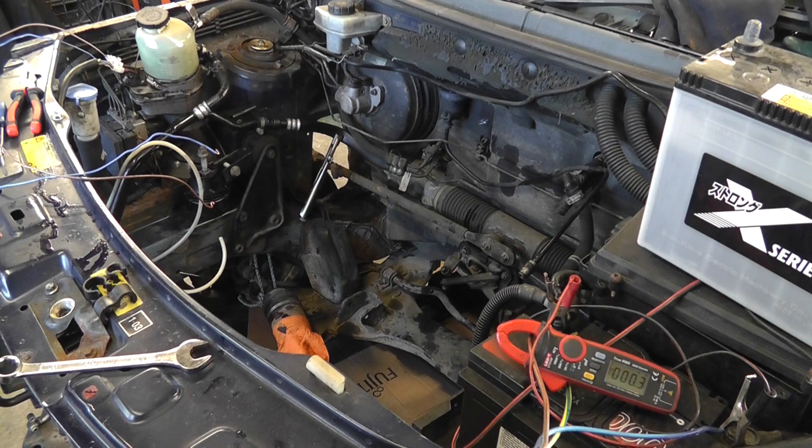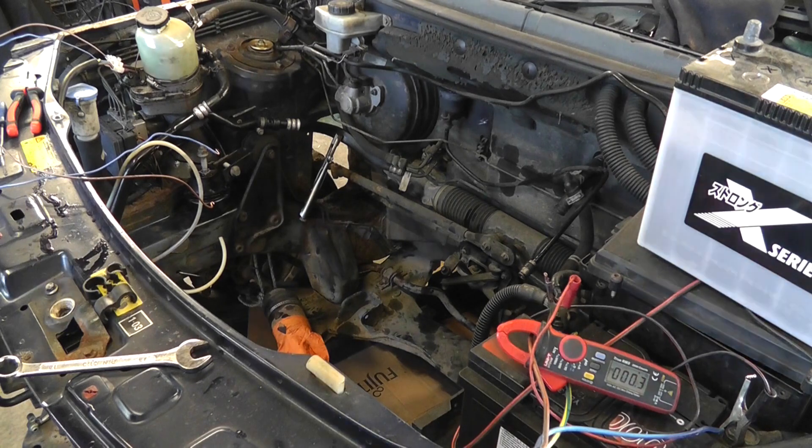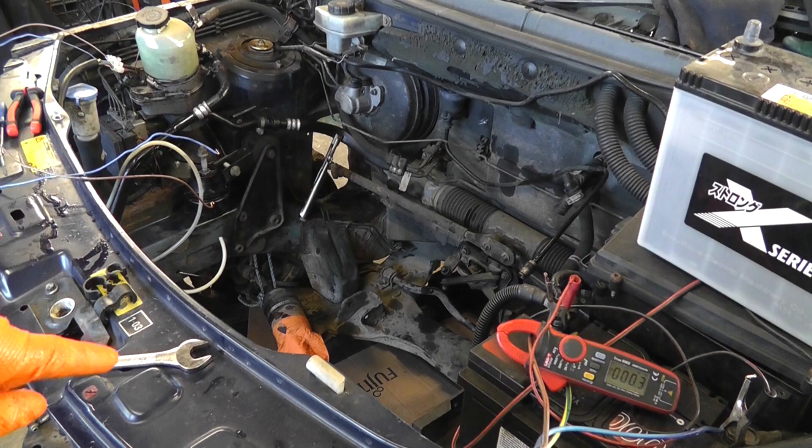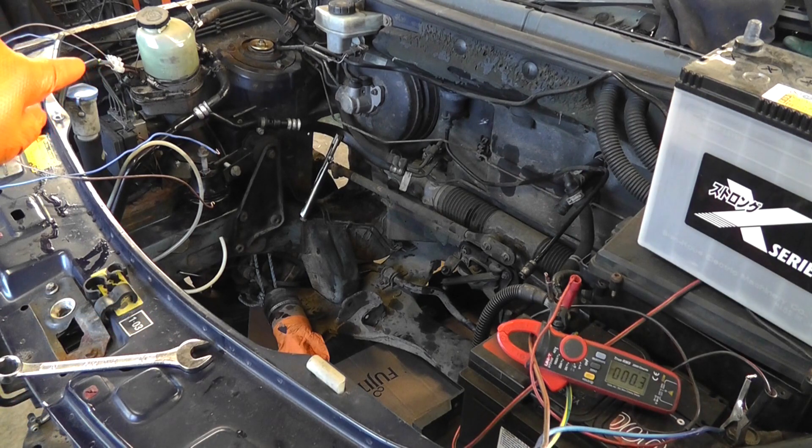For all of you who have been watching these videos of my increasing levels of failure, thank you for watching and thank you for your suggestions. One idea I came up with myself was to try and restrict the flow going through this steering rack. From what I'm told, this Freelander steering rack requires less flow than the pump is designed to put out, and the question is whether the pump is seeing sufficient back pressure to sense that it has come up to the correct pressure and then come back down again.